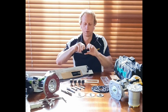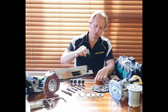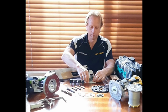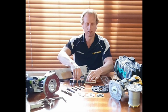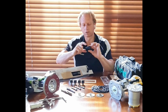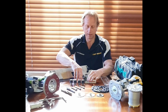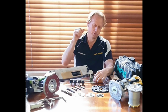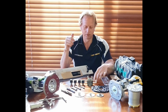So you do top and bottom, turn it over, but it lines up better because a single corner chisel can twist. Depending how you hold it, a lot of people I see on Instagram are so fast, like boom, boom, boom, boom, and it can twist and wreck your edge. It's not a perfect cut, but this lines up because it's got a longer side on it. It helps you to stay dead square, 90 degrees. Tap, slide up there. So this beats the other ones on the market in Australia. That's the best so far.